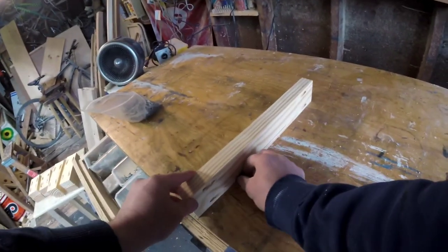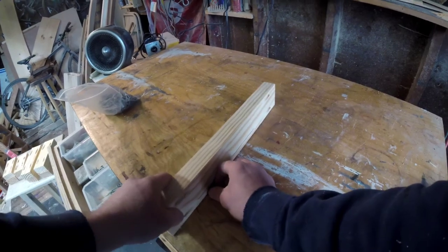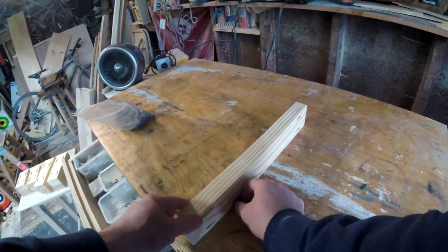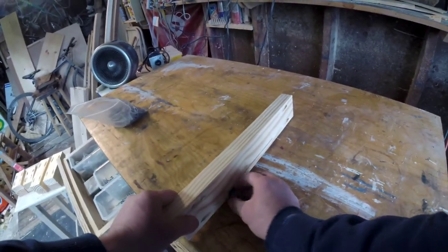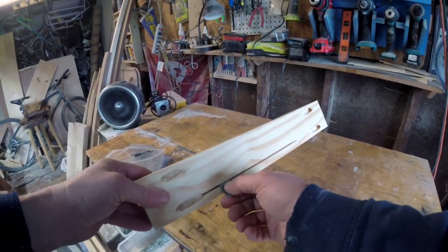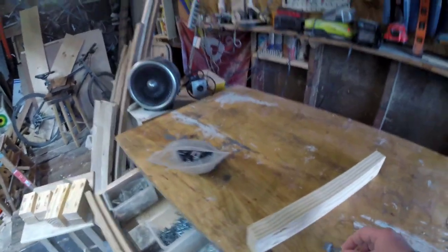That is pretty much perfect, as you can see, it lays flush. So pretend this here is the bottom of your tabletop, and this is your top stretcher, so it'll sit like this. And then you just pilot hole a self-centered bit and screw them into the top. And this allows for tabletop movement if need be. If your tabletop wood does move, especially pine, will move up to a quarter inch a year sometimes, depending on weather, temperatures and things like that. All right, so let's knock out the rest of these.